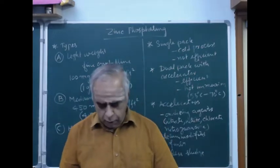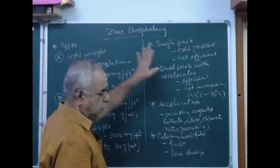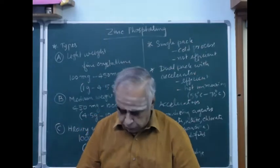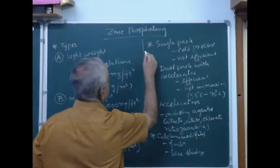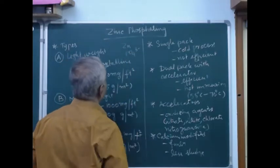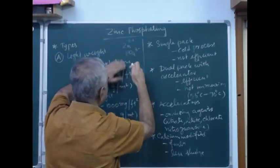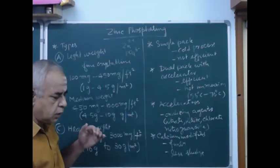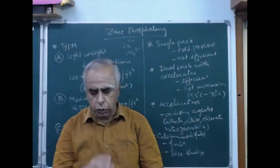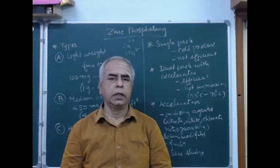In this session I will be explaining about zinc phosphating, one of the most frequently used metal pretreatments in many metal finishing industries. The formula is Zn²⁺ and PO4³⁻. As expected, it will not contain only zinc phosphate — along with that, you will also have iron phosphate, but when it becomes ferric phosphate that is thrown out as sludge. So it is a combination of phosphates with the major zinc ion and phosphate ion.